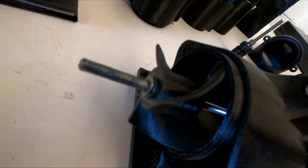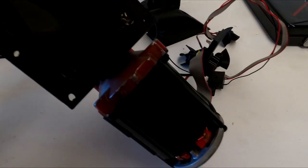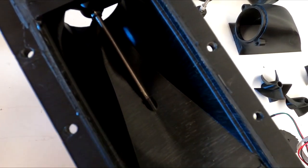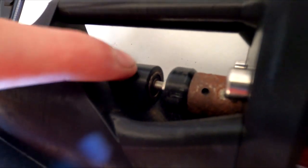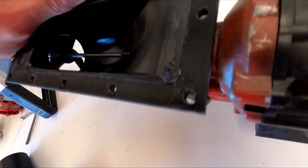You've got the impeller mounted right here. There's an inside view. I've made a little plastic piece here on the intake go out a little bit with the all thread. I'm hoping that's going to stop water going back through this way towards the motor, because I don't want it also going to that bearing there. See, that one's rusted. I actually need to replace that.